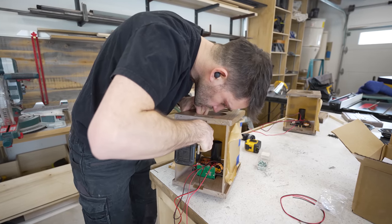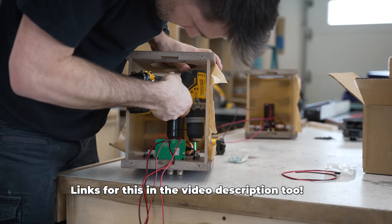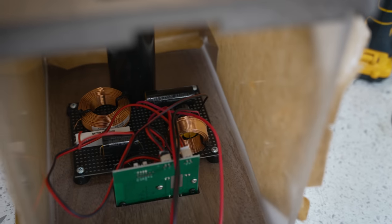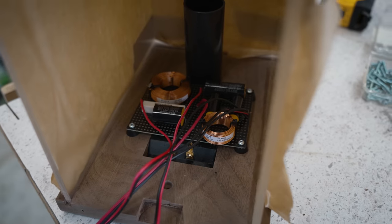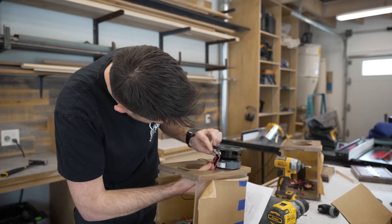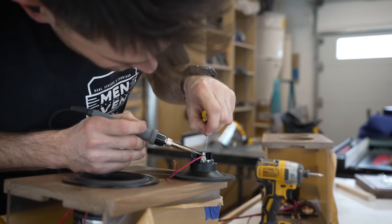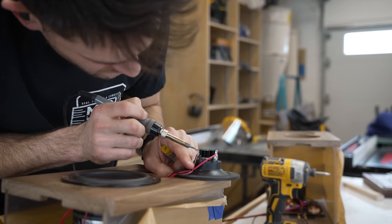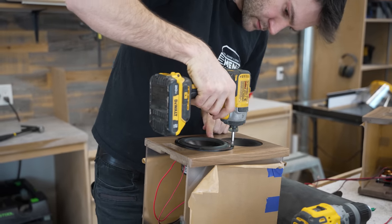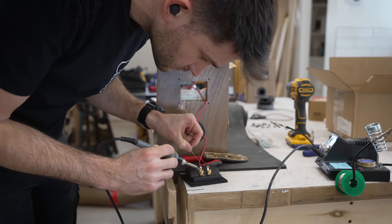These speakers are a variation of the very popular C-Note kit. You've got five-inch Dayton woofers with really cool aluminum cones paired with one-inch soft dome tweeters. The plastic surrounding the tweeter is called a waveguide — it's supposed to help the tweeter sound more natural, and it also recesses the tweeter for an almost perfect time alignment with the woofer down below. After those were done, I connected the front volume control panel, pressed it into place, and then finished up with the rear input panel.